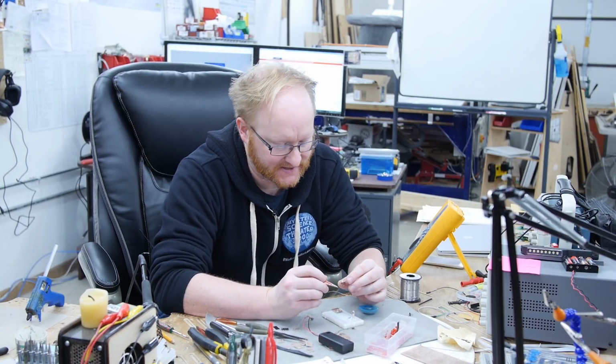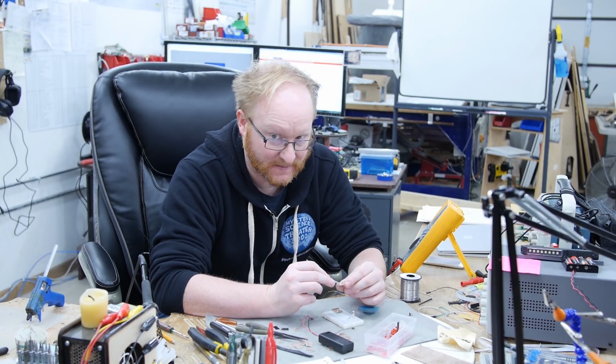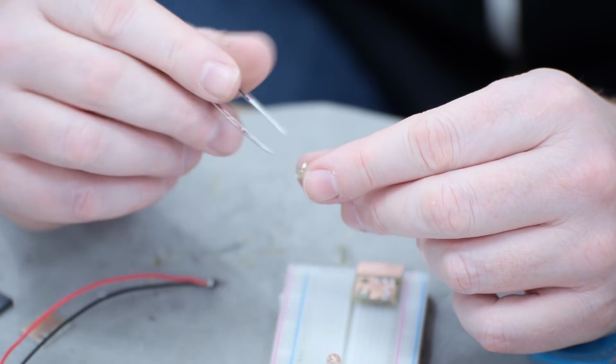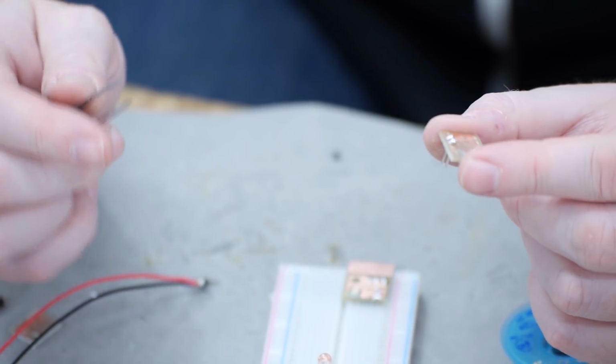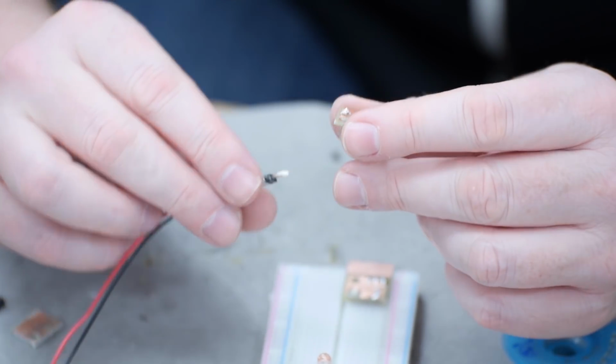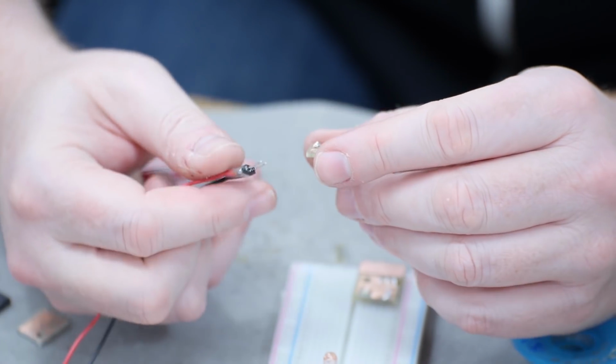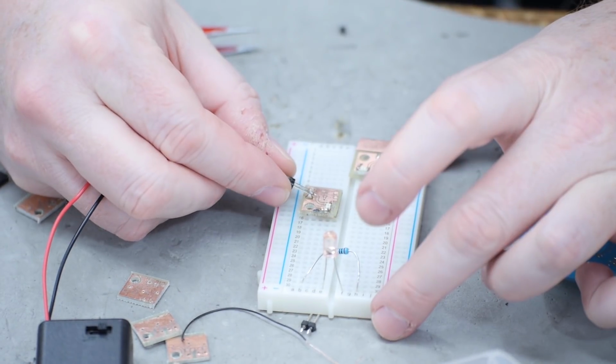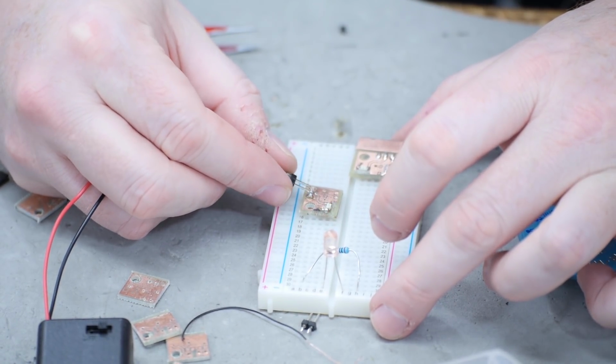So the idea here is you'd send 5 volts to all these modules, and then you return the ground of the LED, and that goes into the Texas Instruments LED controller chip, and then basically once it sinks the ground for a certain light, the light will turn on. Let's see if it works. Yay!